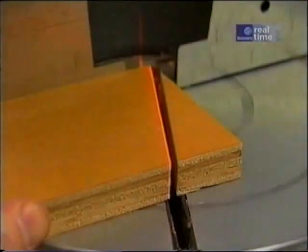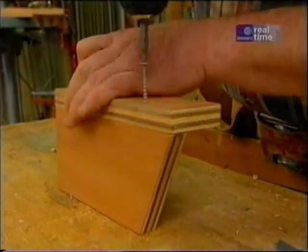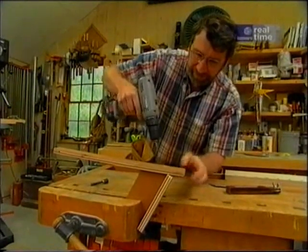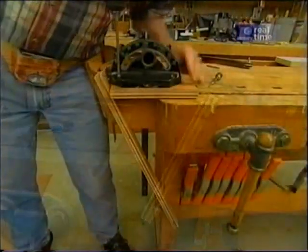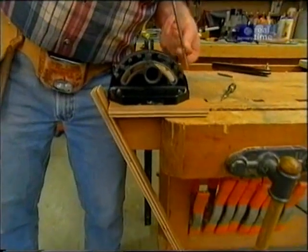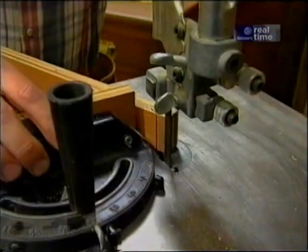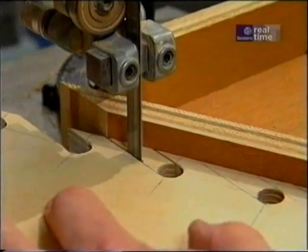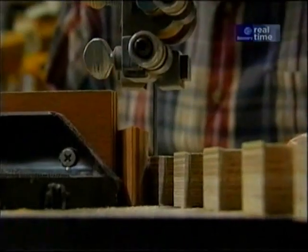The first part of that jig is this piece of plywood which I'll rip off one end at 25 degrees. Here I'm attaching a narrow piece of plywood to that angled piece. Now this long narrow piece will become the new fence. And now a couple screws to attach the jig to the miter gauge. The first pass will be to clip off some excess on this fence. Now I can use the intersection of the fence and that angle as a reference point to cut out the material to each hole.